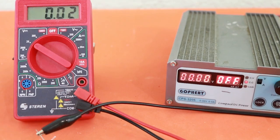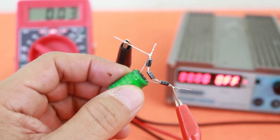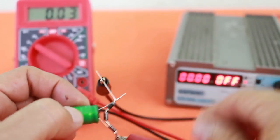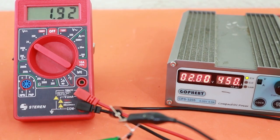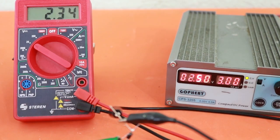Of course, if we need more voltage in the capacitor, we can put diodes in series. Here I have three diodes. Since each diode has a voltage of around 0.8 volts, the maximum voltage in the capacitor with these three diodes will be around 2.4 volts. Let me connect the power supply — I'm going to use first 2 volts, which is lower than 2.4 volts, and we will see that the capacitor will be charged to 2 volts. But if we now use a voltage higher than 2.4 — let's use 2.5 volts — the diodes will try to stabilize the voltage at 2.4 volts.